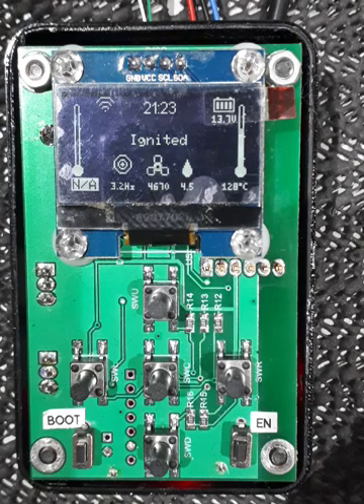I could actually bring up a web page on my phone. Likewise, I can run a Bluetooth app on my phone, and when Bluetooth is connected a little Bluetooth symbol will appear next to the Wi-Fi icon. I'm still trying to heat up the heat exchanger and get everything stable. There we go — it's transitioned to running. This is the normal run state: the target pump speed is 3.2 Hz and it's steadily and slowly backing off the pump rate and fan speed to hold that setpoint.